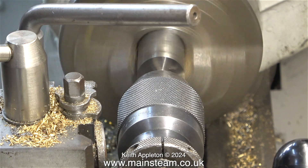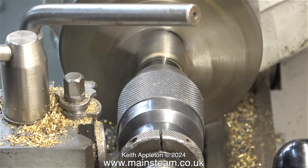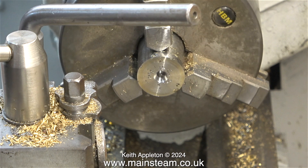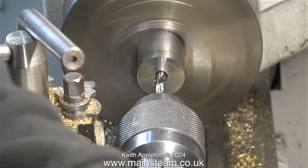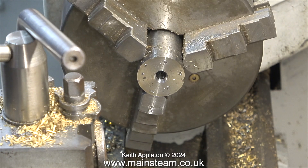What I'm doing here is centre drilling the part, being very careful not to snap off the centre drill, using plenty of lubricant. You can hear how it started to chatter. Eventually I get a really nice centre hole in the end of the piece of bar. The next part of the operation is to fit a twist drill which is tapping size for M6. I normally work in imperial measurements, so why am I suddenly using metric? Simple — I only have stainless steel metric bolts.